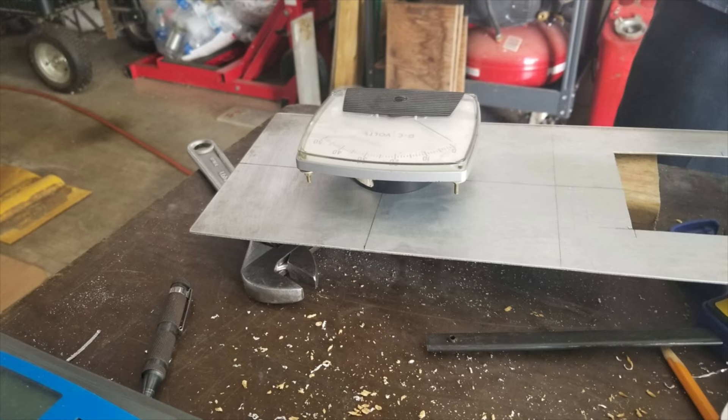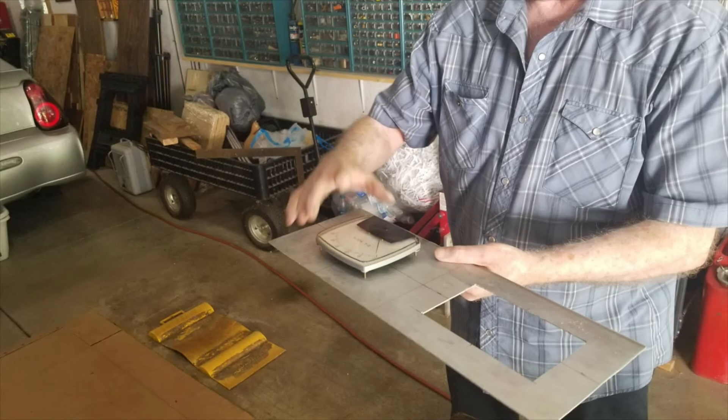We just took our time with these panels — you're going to make it once, so it doesn't hurt to put extra time in on the front end. Here you can see the meter is going to sit nice and flat. We drilled those four holes and can now mark them accurately against the metal. The cutout for the charge controller is clearly visible — everything sits nice and flush, looks professional. On the outside edges and corners, we'll put in holes for the 19-inch rack mounting itself.